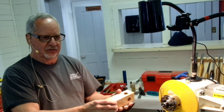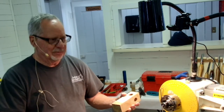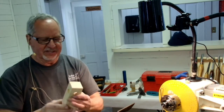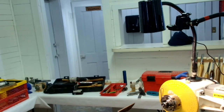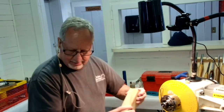You've got to get it centered just right, and you've got to clean it off with a spindle roughing gouge just right, or you have problems. I'll pass that around. You don't necessarily have to drill halfway through. You've got to drill deep enough that as you get into it, it's just covered. And so...